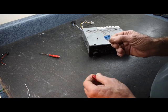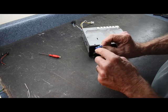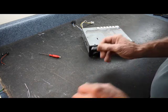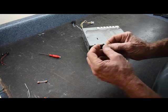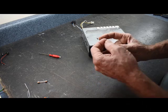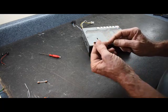Colors do designate amperage. There is a second type of blade fuse where you can see the filament through the top. You can also read voltages from both sides of this filament at the back of these fuses, so you don't have to pull them out. And then we had the glass barrel fuse with the filament in the center, but Mercedes and BMW did something a little bit different, where they used a ceramic piece with caps on the end and the filament along one side. We have seen these fit into the fuse panel into 2 pins that have small openings in them, so it locks in. And sometimes just rotating the fuse in these contacts cleans it up, or you can take it apart, clean the ends, and put that back together.